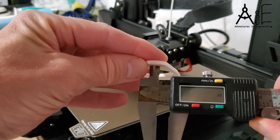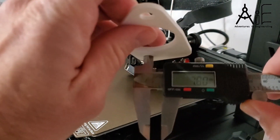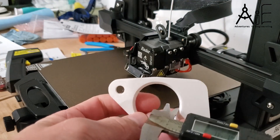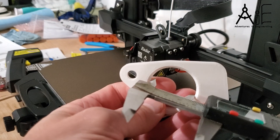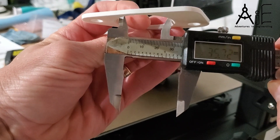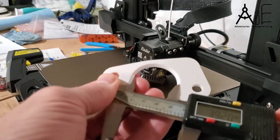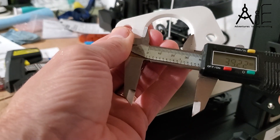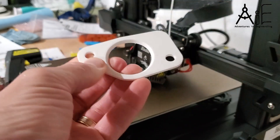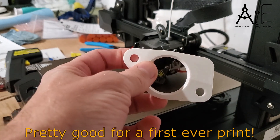This should be eight millimeters. The melted plastic bleeds inward a little bit — it expands inward into the holes slightly. This was supposed to be 36, came out at 35.7, and the taper goes to 40 but measured more like 39.3. Not bad, and I can tweak the settings and maybe make the holes a little bit bigger to make the print come out better.